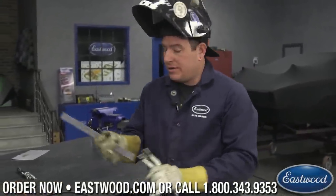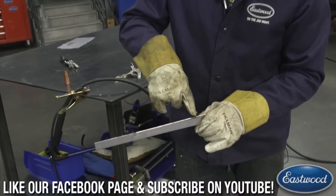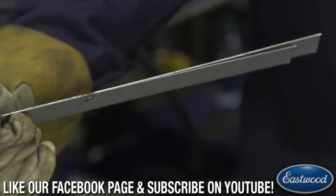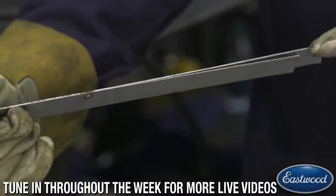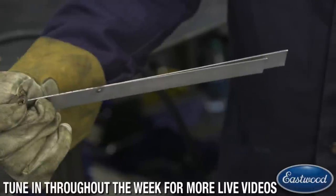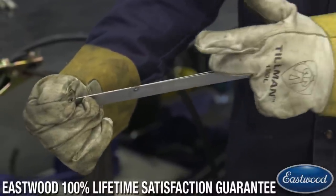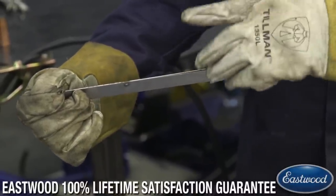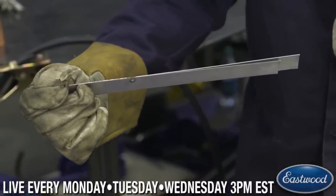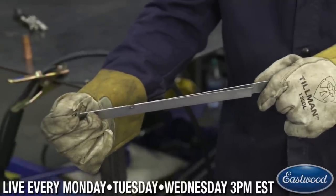This is still tightly together. This is an area where these pliers really come in handy. You can see there's a gap here — this is what happens a lot of times when you're welding two pieces together: they're going to be more spread out here. Even if you clamped it there, you can't just assume everything is okay — you're going to have to clamp each one slowly to pull it together. So if you have a gap like any of these in your panel, you're going to have an area where the panel's not flat and you may not get the weld you want.